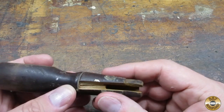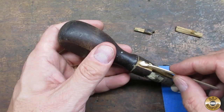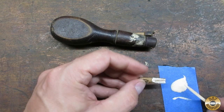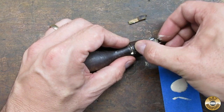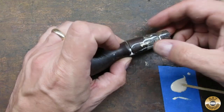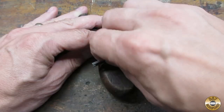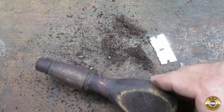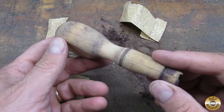I think the tube of Flitz and I are back on good terms now. I decided to pull apart the cracked section of the handle, then used wood glue to glue the pieces back together. After the glue had dried, I used a razor blade to scrape off the finish. Scraping the finish first saves clogging up the sandpaper.